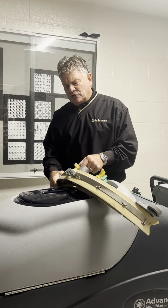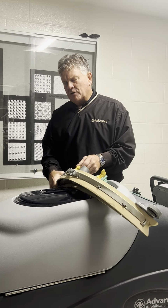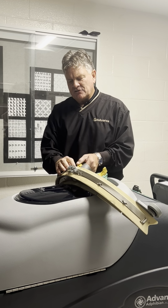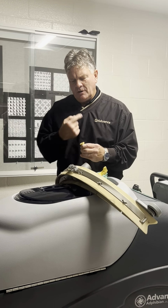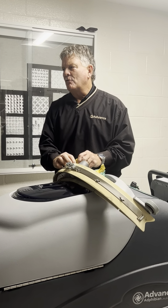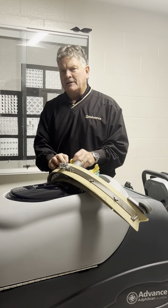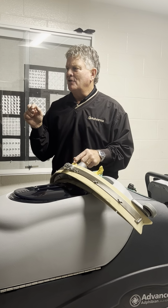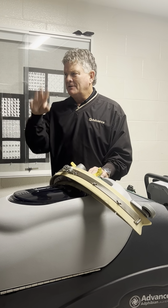These thumb screws, it's a water environment, so you may want to keep those lubricated. You can simply take these off, maybe once every month or 2, and put a little lubrication there. Grease is better than WD-40. It's a little too thin, but some white lithium grease. You can get what looks like a toothpaste tube full of white lithium grease on Amazon or at AutoZone, and it can last you the life of this machine.